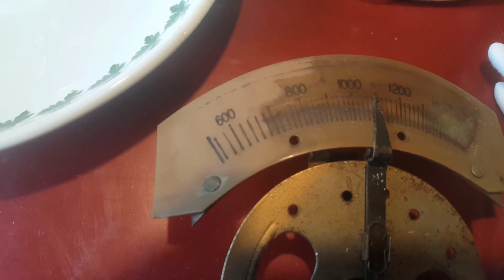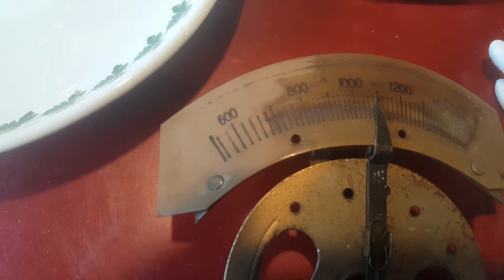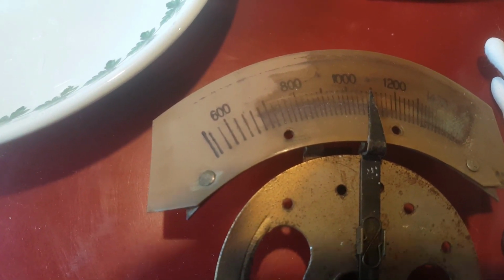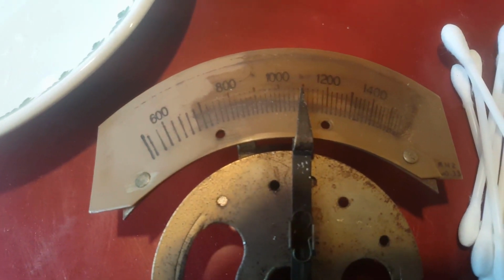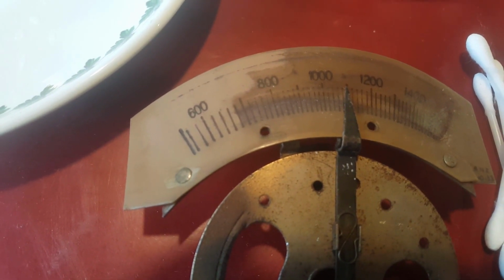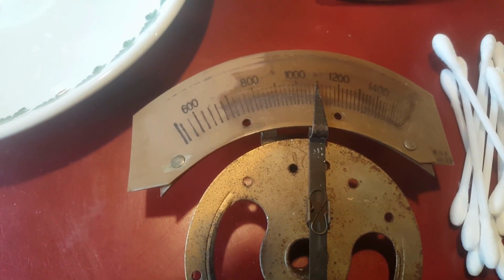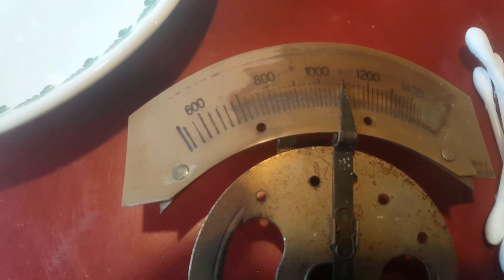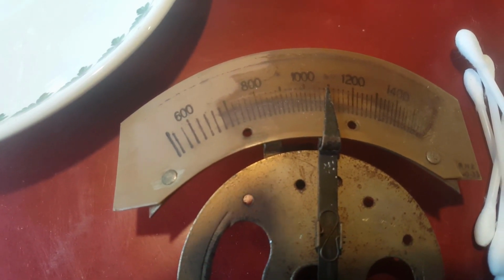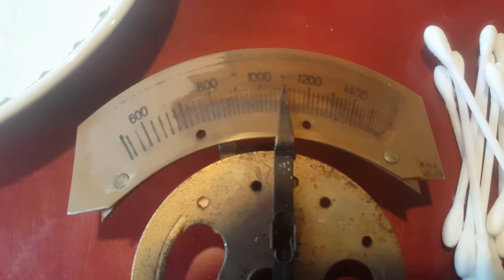which is kind of the last thing I tried, because water-soluble inks were quite common. And water's working really well, so I slowly worked my way across to almost 700 on the dial, and there's probably 10 minutes' work getting the first 5 or 6 bars and the 600 uncovered. So this is going to take me a while, and I'm obviously going to need to be quite careful. It's quite good with the bars being so far apart, because I can rub between them with a cotton bud. As I get further up, those bars come closer and closer together, and I won't have that freedom.